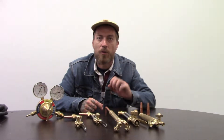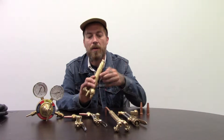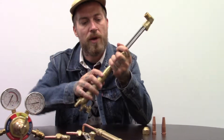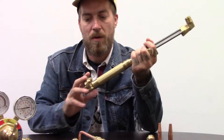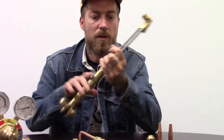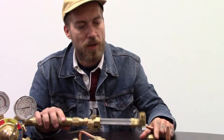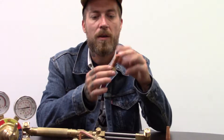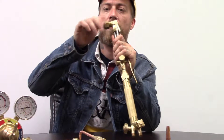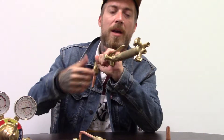Lastly we have the heavy-duty cutting torch, which is what I use for my oxy-acetylene setup at home and on my rig. I'm going to show you how to put this together. Here we have the heavy-duty body — thread it together onto the head. We have a million different types of cutting tips and heating tips, so today I have a standard size cutting tip. Take that, drop it through the nut, and again you just hand-tight thread this on. There's no Teflon tape on the tip end, but I would put it down at the body connection.